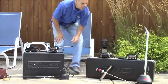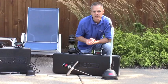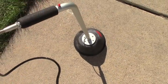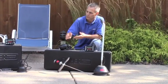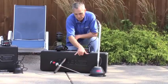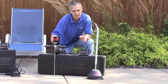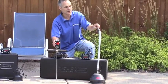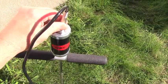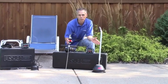With the XLT 30, you can listen through the concrete deck with a big rubber boot that's a bit more heavy-duty than the multi-sensor on the XLT 17. There's also a rigid handle attached, so if you take your hands off the microphone to adjust the controls on the amplifier, the handle stays in place — whereas with the XLT 17 you may have to reach down and grab the handle again. The XLT 30 has two separate microphones: one for listening through the concrete deck (the big foot) and a separate probe microphone. Instead of adapting one microphone for both situations, you choose either the deck microphone or remove the input cable and plug into the ground probe. Each microphone is better suited for its particular application, making it a more robust and durable system.